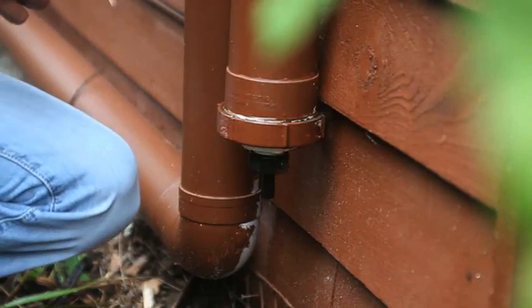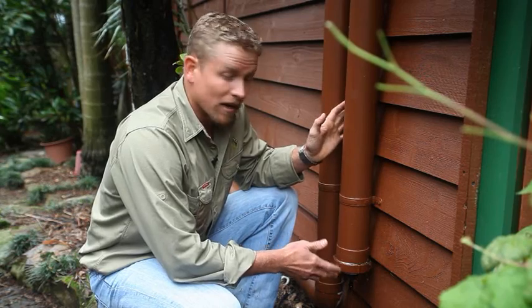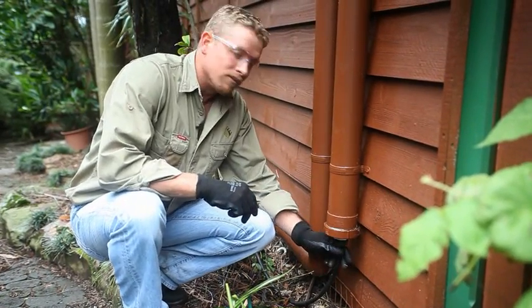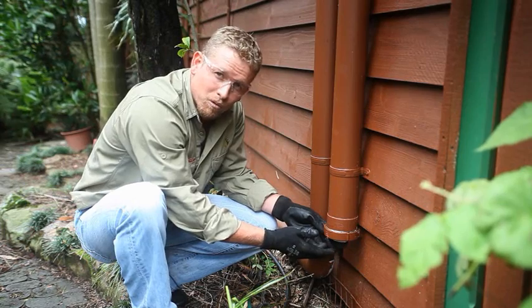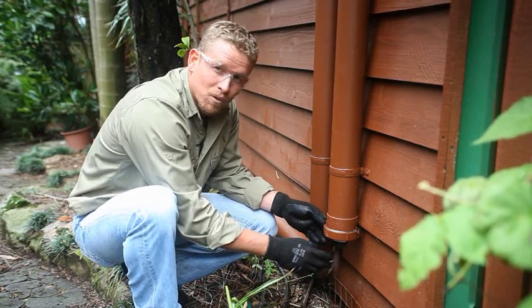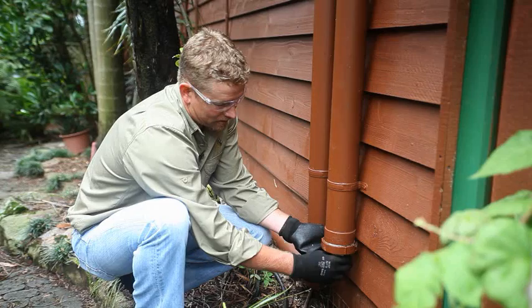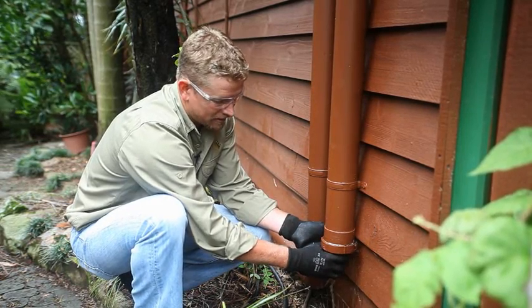This is one of the most important parts of your rainwater tank system to maintain. Debris builds up quite quickly in this little chamber. I would recommend that every two months this be cleaned, depending on how clean your roof and gutter is and rainfall events. I'm going to put my safety gear on and show you how to clean one out. To clean the first flush, it's a simple matter of removing the irrigation hose, then removing the small black fitting first — this reduces the amount of water that gushes out instantly. Then unscrew and remove the filter.